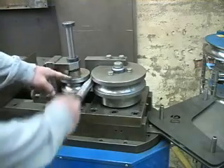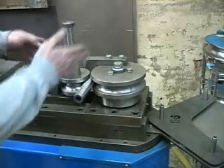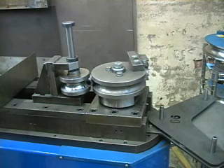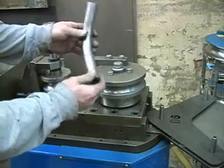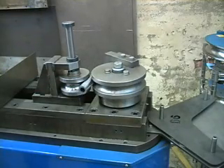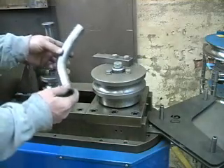We've got this spinning counter die, so when the piece is bending, this counter die will actually rotate along with the piece instead of having a fixed counter die where the tubing would drag across it, possibly scarring it up. And there we have one side of the S10 upper control arm tube already bent and formed. I'll go ahead and do the other side since we have it set up. There we go — we have a perfect bend every time.